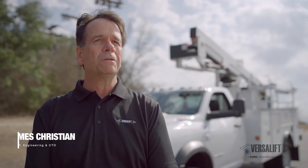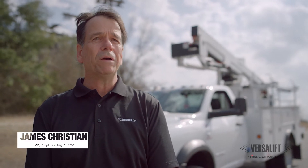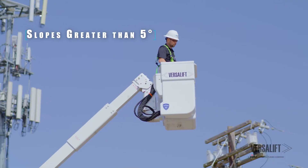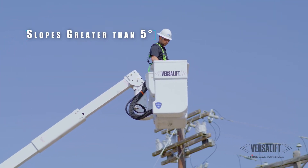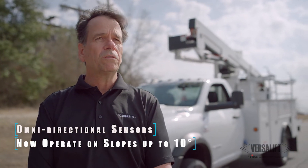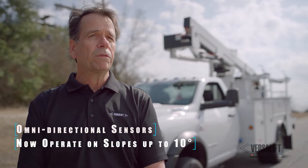Utility poles and telecommunication lines aren't just built on flat ground or five-degree slopes. The OSHA regulations say that you're not to operate on a slope that's greater than five degrees. However, we all know that you'll find power systems, telephone systems, any area where you're using an aerial man-lift, that there's going to be slopes over five degrees. If you work on a slope higher than five degrees and the equipment isn't designed for it, you can stress out the rotation system and cause failure. So it really is a safety issue.